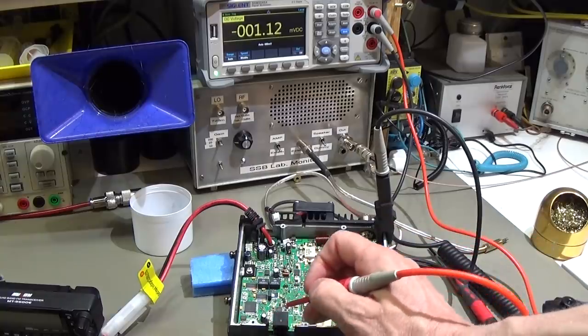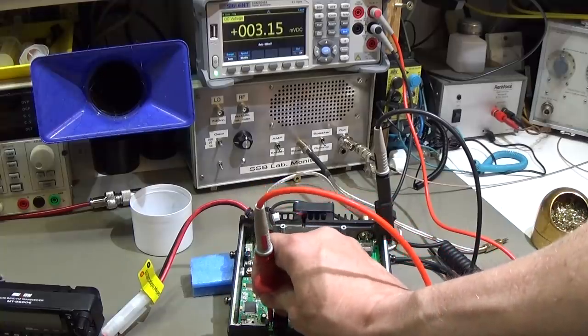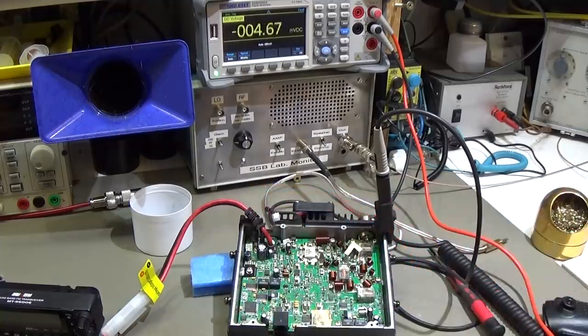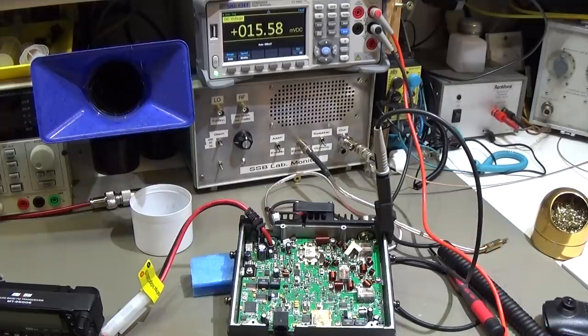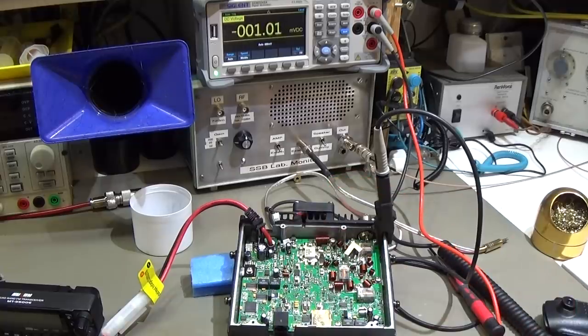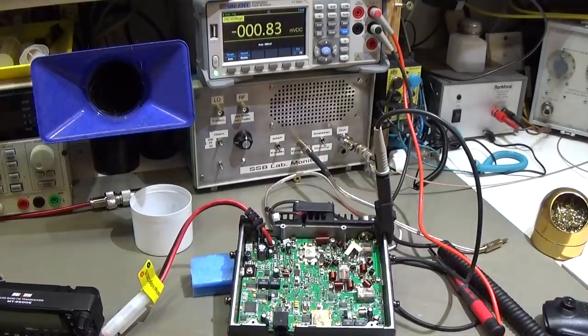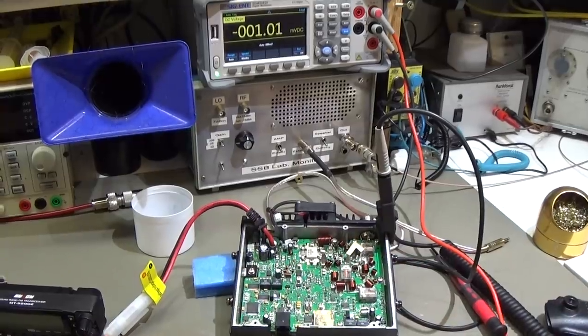Yeah, a 5 volt regulator finally, and here our second side of our resistor is simply the input of our voltage regulator, and we should see maybe a little less than 13.5, maybe 13 or maybe 12, so it doesn't matter, but not only 2 volt. So let me look into the diagram for this part.